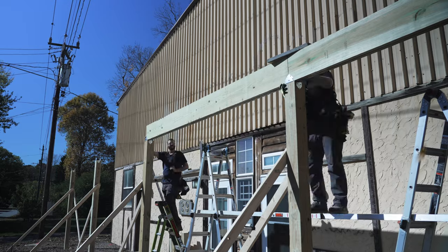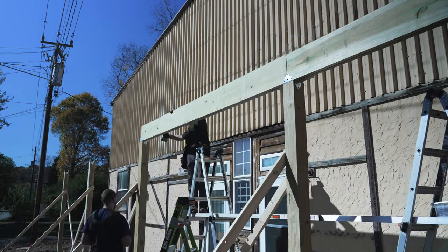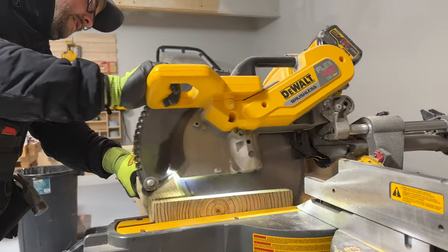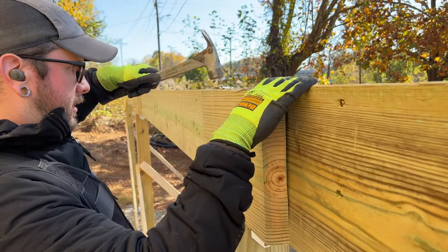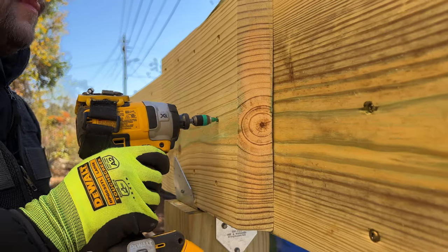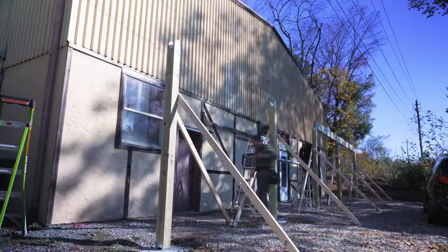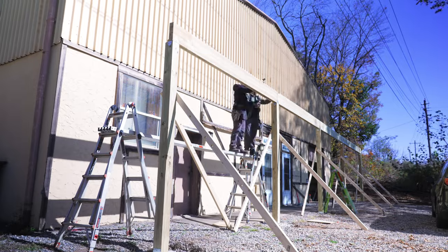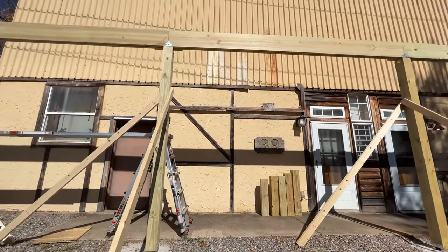We repeated the process on the next beam, which was also a lot shorter — just under 13 feet. Next I needed to cut more filler pieces using the off-cuts from the shorter beams. I did this at my miter saw inside the shop and left them fairly long, around 18 inches, figuring that lapping the filler board between the two ends of the beams would help tie everything together even further. We repeated the same process for the next two sections of girder and before we knew it the front half of the porch was really taking shape.